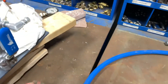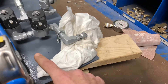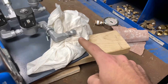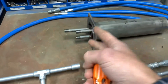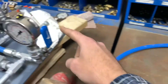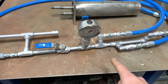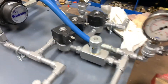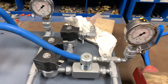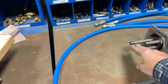Sometimes there are two configurations where there is a secondary section with the third solenoid, which would have the secondary hose. The primary connects out into one line with two branch offs to feed two outputs for low fire. The secondary hose comes out onto a second line with a single branch off connecting to your high fire, so you have two pressure outputs segregating one nozzle that is only activated on high fire.